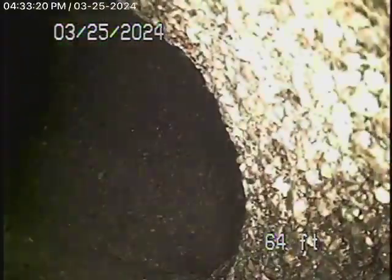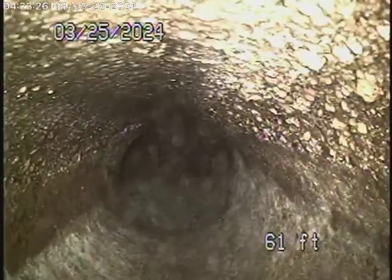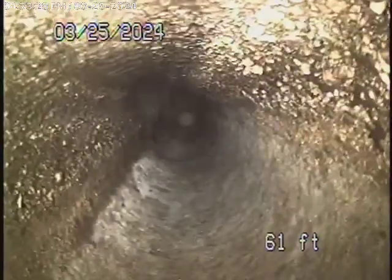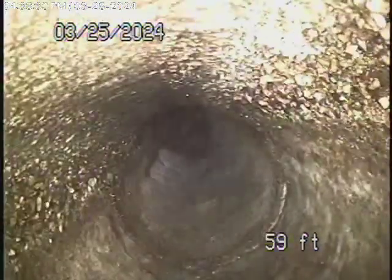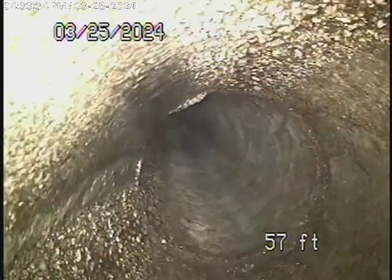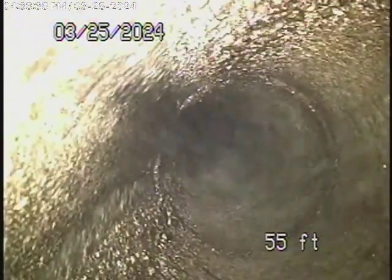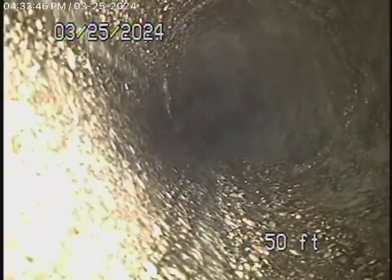This inspection is based on my opinion. As we come back, we're in a 6-inch concrete pipe that, in my opinion, is in fair condition. A public works inspector may have a different opinion, but this is my opinion. You can see it's functioning — it looks like it's pretty fair condition. It's pretty deep in the street; it was like 13, 14 feet at the city connection.